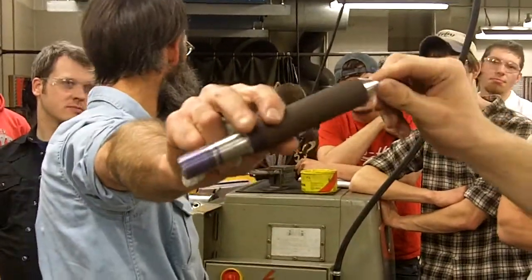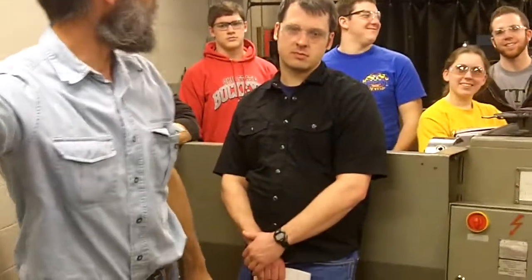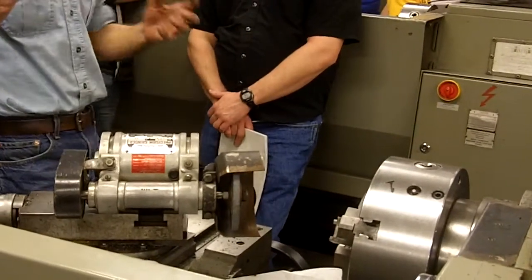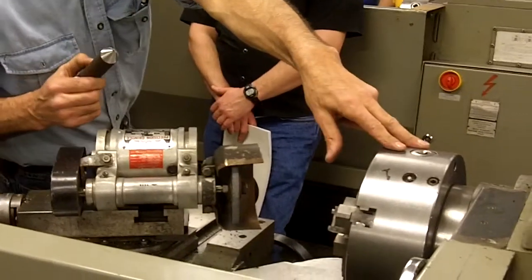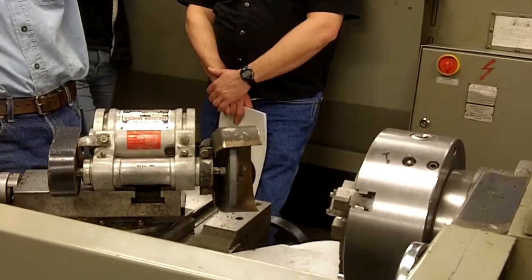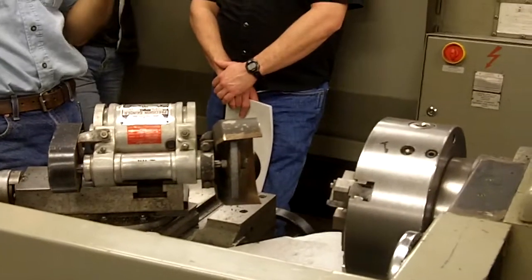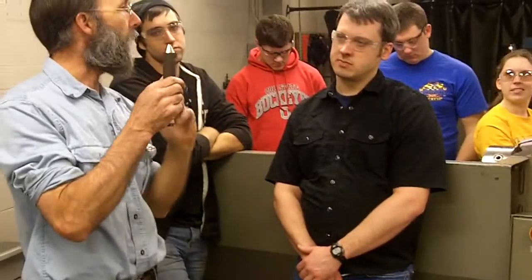Now once you've seen it, it's pretty easy to come around and start seeing what else has been ground in this way. All right. We take the chuck off of our spindle. The spindle nose that fits on has definitely been ground. The inside of the chuck that mates to that has been ground. Outside surface, ground. Spindles for lathes, spindles for our Bridgeport mills, precision fit bearings on them, all of them are ground. Once you recognize the type of finish you've got, you can see where it's been applied.